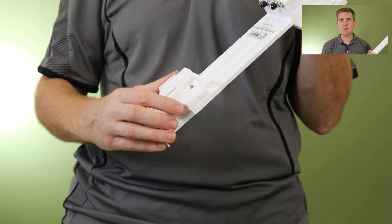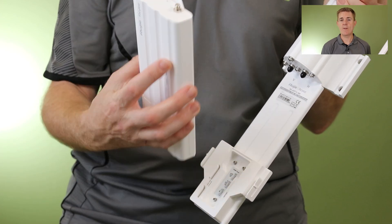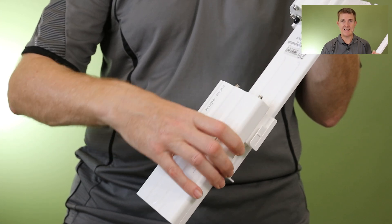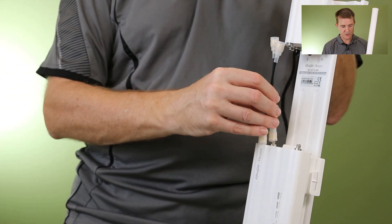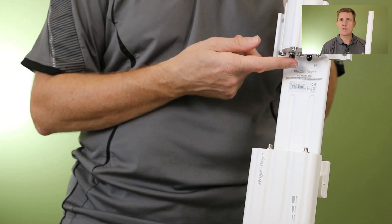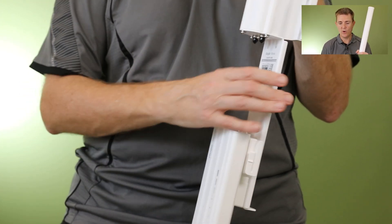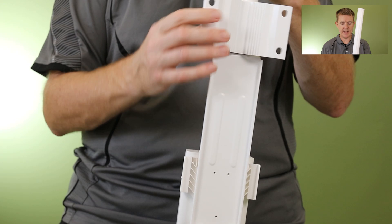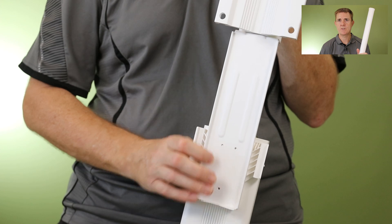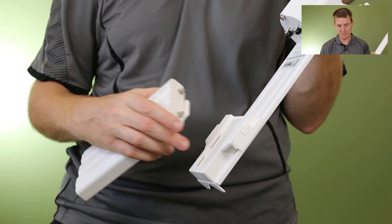At the bottom we have the mechanism for the base. I've got a 550G base here — this does not come with it, you have to buy the actual transmitter separately, as this is just the antenna. It slips into place and clips down, and you then use the two short connectors to connect it to the physical antenna after removing the two black covers. Make sure it's fitted, then get it up nice and high, bolted and secured into place — there are screw holes to ensure the device doesn't come loose.